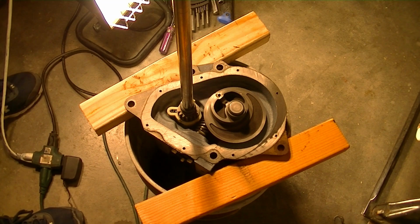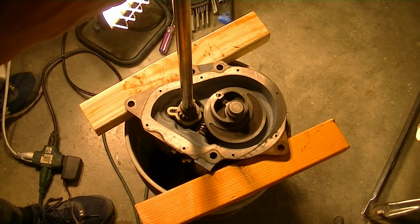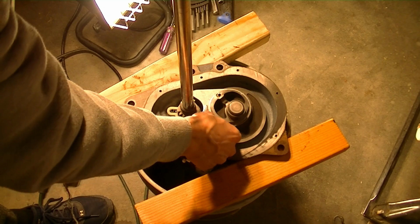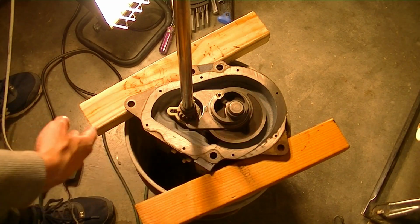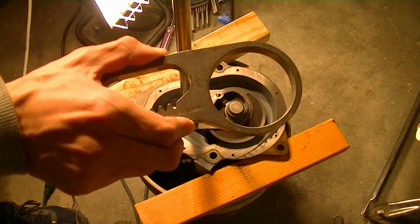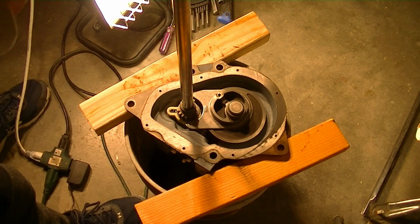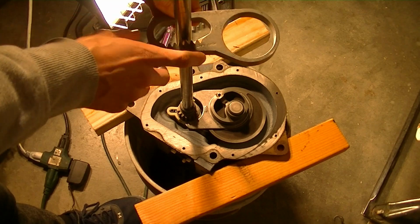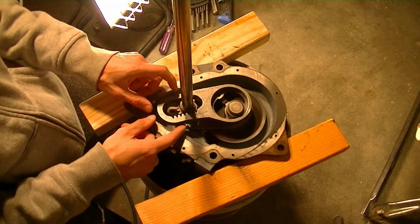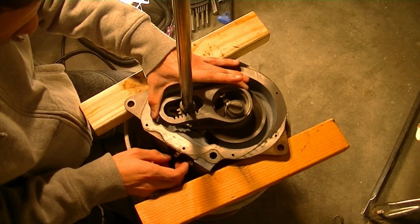Then this rack retainer gear, which lines up, it goes, I believe, this way. I think, yeah, because it has to push that down, and everything will line up kind of as you set it in. If I said that was the rack retainer, then excuse me, because this is the rack retainer gear or whatever. This would be considered the shift actuator piece, and that slides over like this. This goes on this side, slides on like so, and then it meshes in the middle of these teeth on the agitator gear, which you have to kind of finagle by turning the transmission shaft as you go.